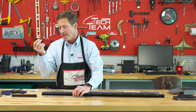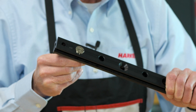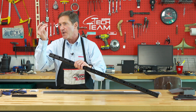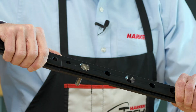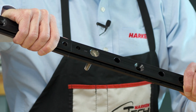The reason for that is the underside of a flathead fastener fits nicely into the track, but that's a wedge — and if it's misaligned at all in terms of the hole in the deck, the back of the mast, or the slug compared to the track, this wedge will pull the track off center. That's why the dowels and the splice keep them aligned properly while you're putting the final torque on the fasteners in the back of the mast.